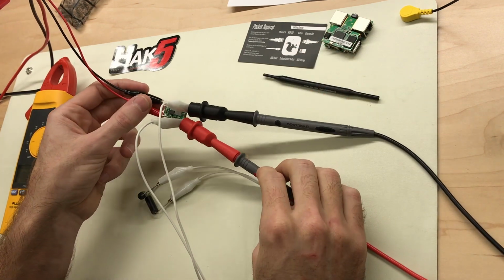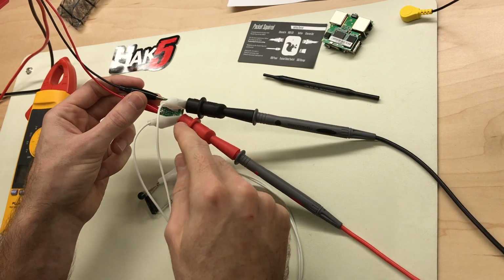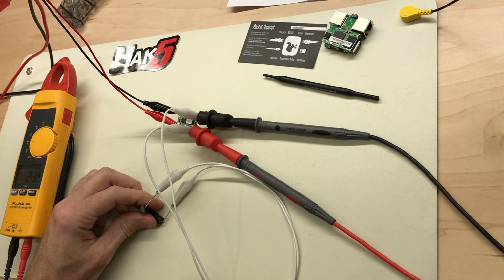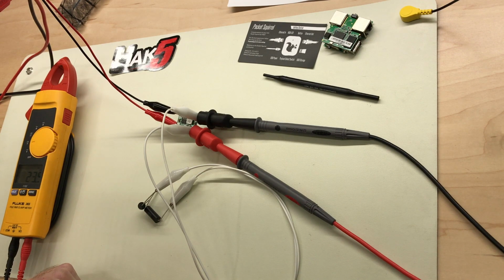The little trim pot below the inductor is already set. I don't know if you can see that or not. So right now we're pulling a 1/4 amp, outputting 5 volts, 24 volts in, everything's working great. That's what it's rated, but I need to make this work at 48 volts input, because that's what Power over Ethernet supplies, is 48 volts.